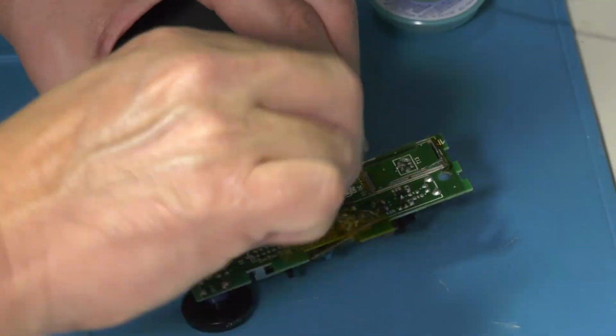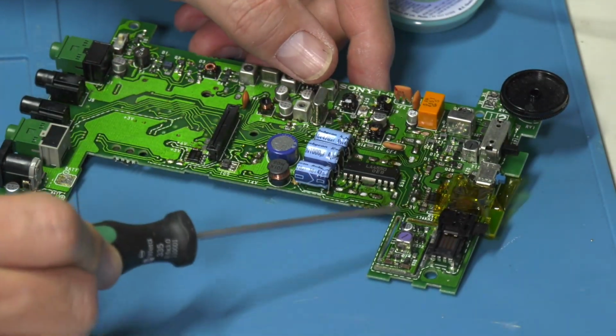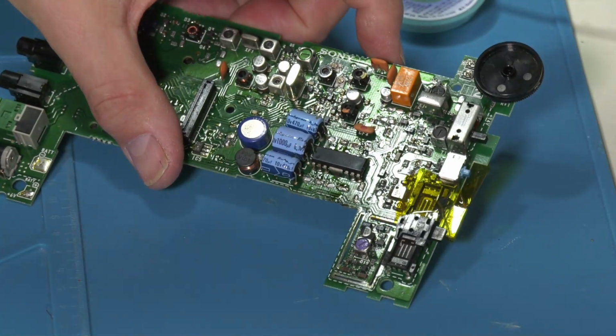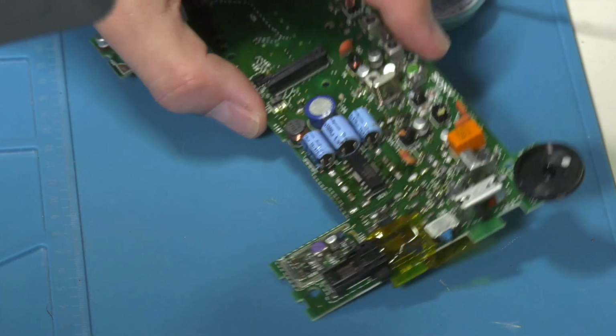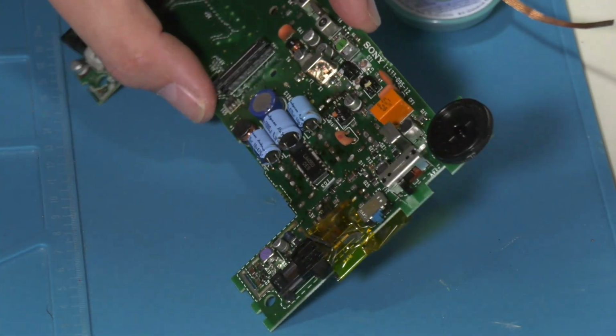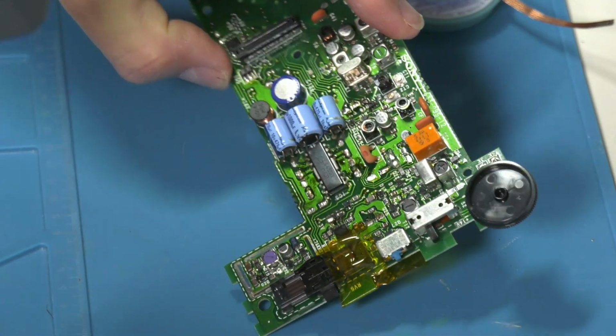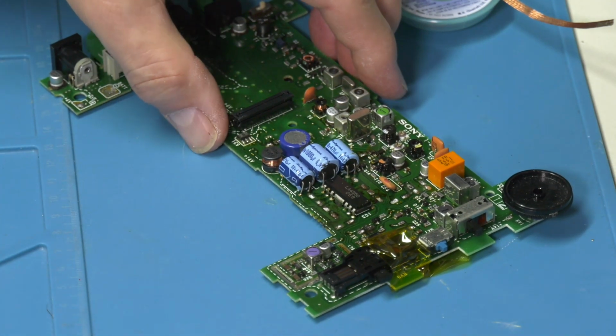There we are. So there's our other electrolytic. Again, that one's pretty tight into everything, so we may do the twisty on that one. It doesn't look too, yeah, it's a bit of corrosion, so I'm going to have to do that with a soldering iron, that one.